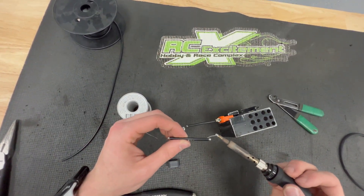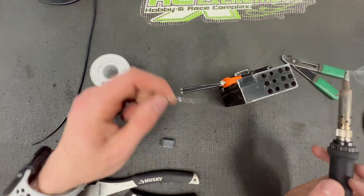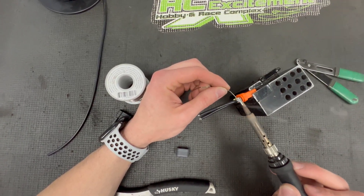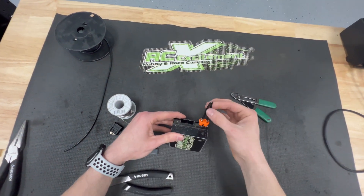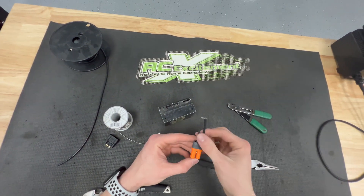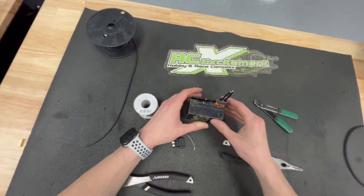We'll remember this is the positive side because both wires are black, so always recheck your orientation. One more time — clean off the iron, add a little bit of clean solder — and then just tap, tap, tap-a-roo all the way to the top. Recheck that your wire length is the same and make sure you're not uneven solder-wise. The clip goes on — I like to use pliers so it squishes on both sides and clips nice and tight. Always check orientation before you solder: positive on one side, negative as indicated on the connector. You don't want any battery smoke — once that smoke comes out, it ain't going back in.